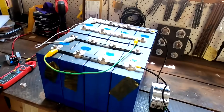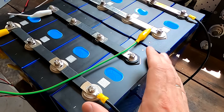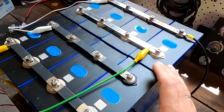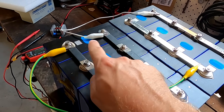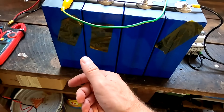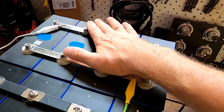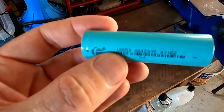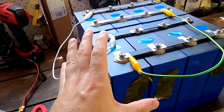This is already one charging method you can use. My first battery delivery had a higher state of charge than the other, so I put them together in parallel with jumper leads. They've been balancing for over a week with still about 100-150 milliamps flowing between banks. We've got 280 ampere hours per cell, so 1120 ampere hours per bank and more than 2200 ampere hours total — compared to 18650 cells at 2-3 Ah, that still blows my mind.